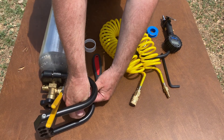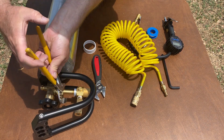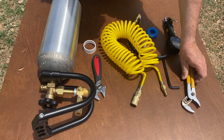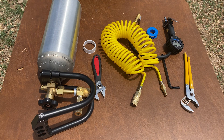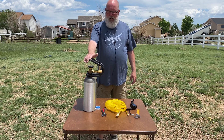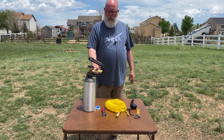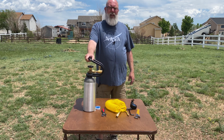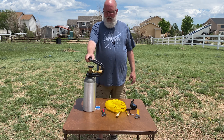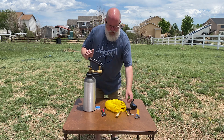Rotate this back into position where I want it, right in the center there, and then crank this baby down. Nice and tight. So everything's put together. The next thing we need to do is get some CO2 into this tank. We got it all put together — this is what the finished product looks like. One of the things we want to do before we get this filled is we want to take off this regulator right here, and we want to weigh the tank with the handle and the tank by itself, so when they're filling it up, they know how much they're putting in and they don't overfill it by mistake. We'll also want to write that pre-weight down with a Sharpie, just so they know.